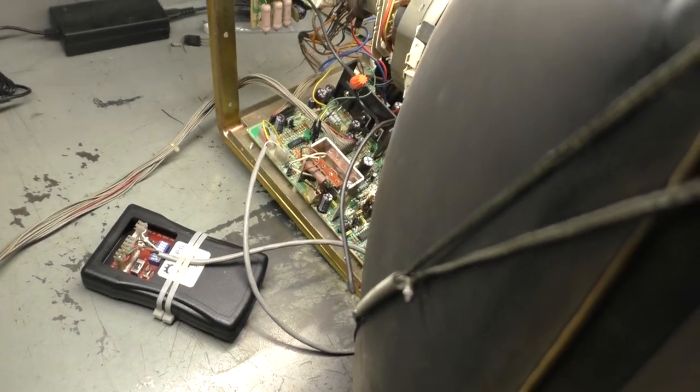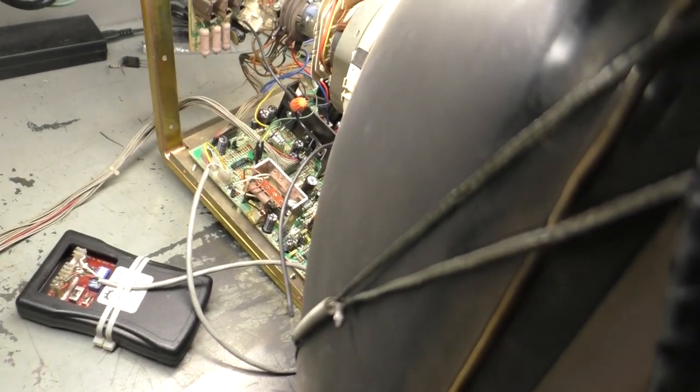Let's try and do vertical size, which is height. We'll do... Uh-oh. Why is that happening? We're getting fold over at the bottom. Why is that happening? That's the limit. Right there's the limit of our... What the... This may be a 27-inch chassis, and it may not work on 25. Do we have the sticker on the... It is a 27-inch. Well, that explains it.